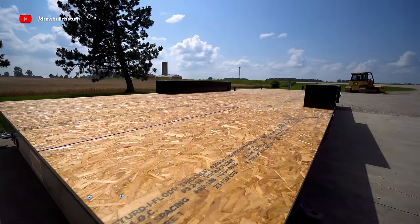The next piece of trim I used, and the piece that gets used to trim almost everything else, is called J-trim because it looks like a J. So along the bottom, I'd snap another straight line at the height I needed it at. And then I'd tack in my J-trim at one end, and then starting from the other end, I would just sink a nail every foot or so, right in that J-channel, as level on that line as I could.